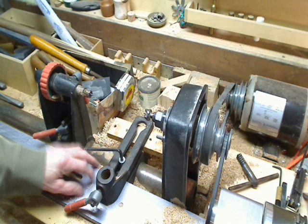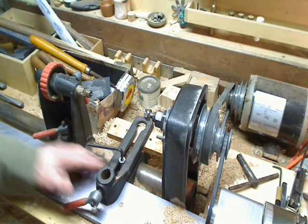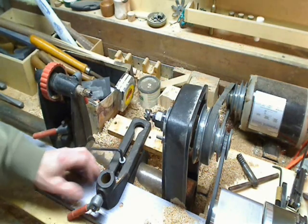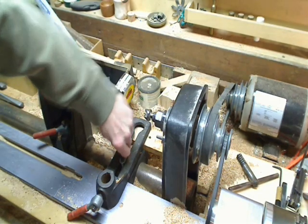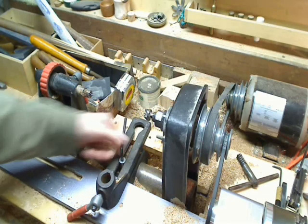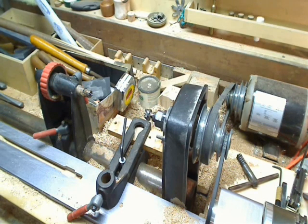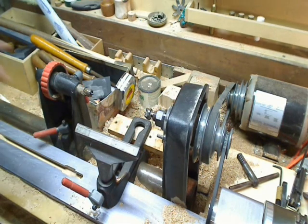Making the two into one system became a little tricky, but it was pretty easy — I basically shimmed the back up with a piece of wood, and then this part stays nice and level on the plate. All I do is screw that down. It's a little more inconvenient than having quick releases, but I don't have anything in the way of the throw of the lathe itself. Here it is with the longer tool rest in place.